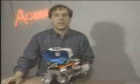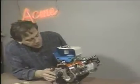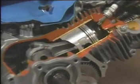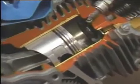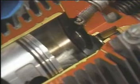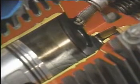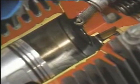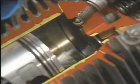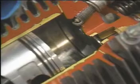So how does all this stuff do work? As the piston moves down the cylinder, it creates a vacuum. One of the bumps on the camshaft is moved to push that back valve open, so air mixed with fuel rushes into the chamber. When the piston gets to the bottom, it starts back up because it's on the crank, but by now the bumpy shaft has let the valve close, so the air and fuel mixture is just being compressed.